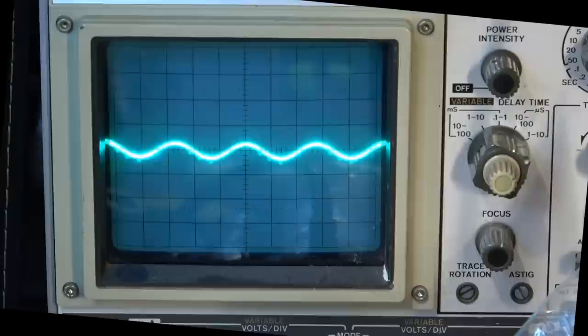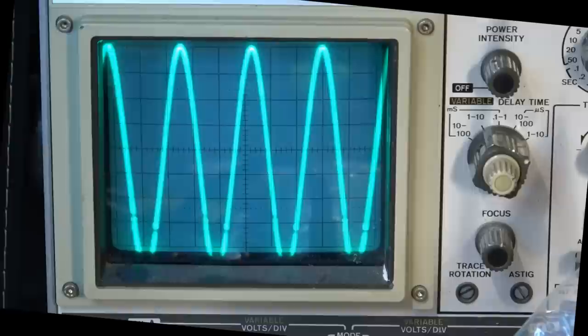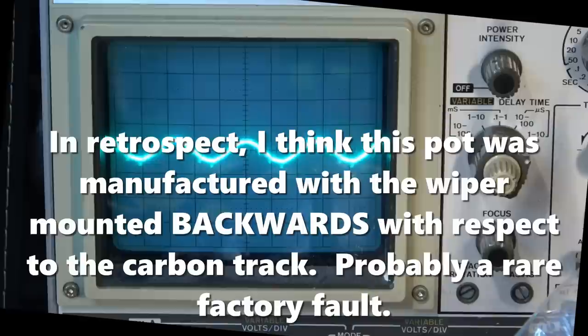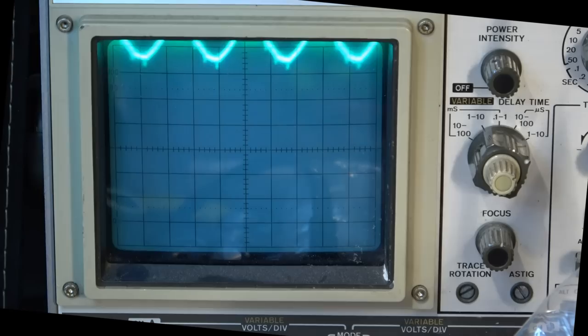It goes from, well, that's the treble. It goes from that all the way up. And I turn it down, it goes to nothing at one point in the sweep. Then it goes to a huge signal, and then very soon after that, gets cut probably, what, in half? And then goes down a little bit more on its way back down to the bottom of that range. But something is certainly not right with that. See that? Something's not right in the tone stack if it's doing that.